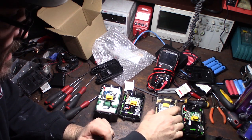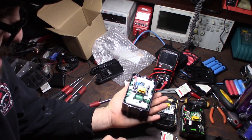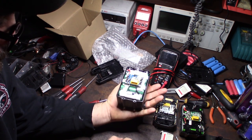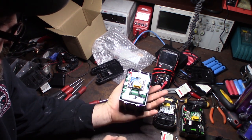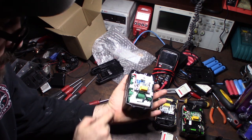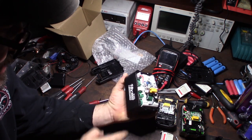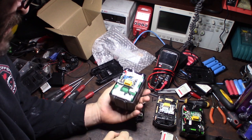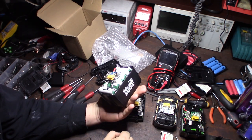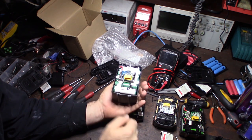I couldn't get the batteries out of the 9 amp-hour easily, but I can count 15 cells in here - it's not just half-filled. It's wired five cells in series across three parallel groups. I feel like I'm not completely ripped off. The cells look pretty new so I'm going to put this back together, throw it on the charger, and see if it works.